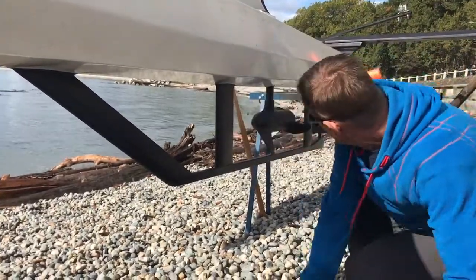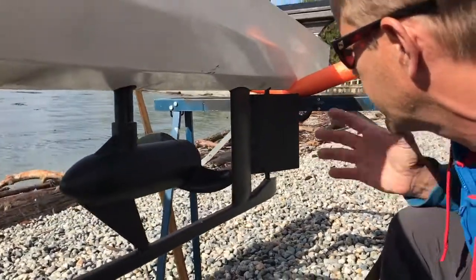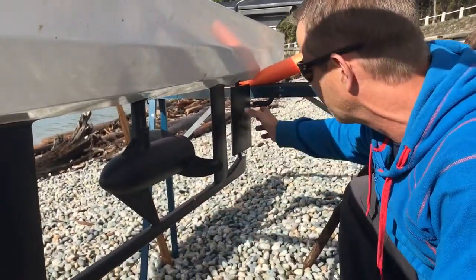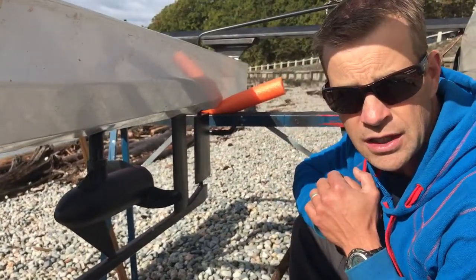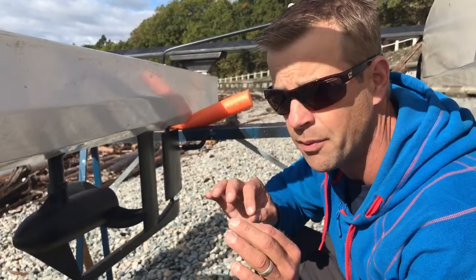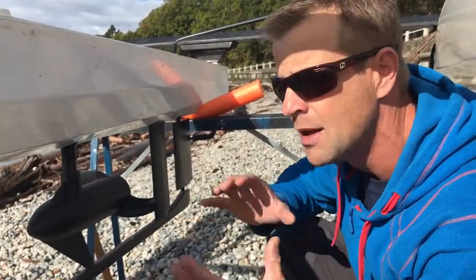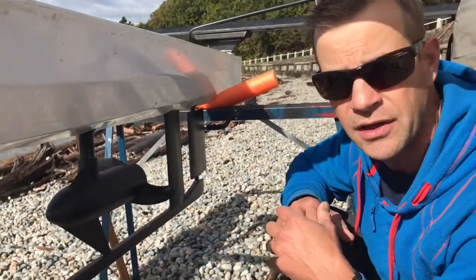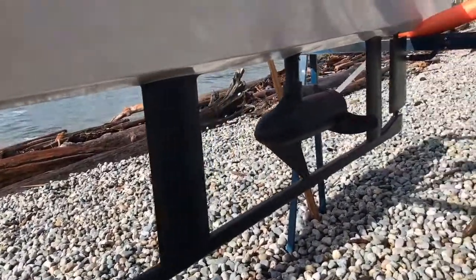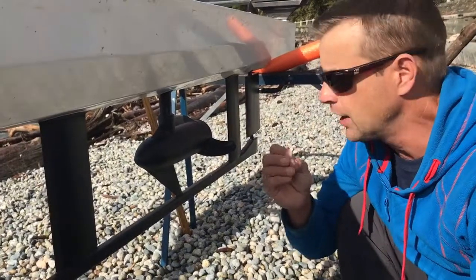This is not the final propeller we're using. The rudder, as you can see back here, is built into the whole unit — it's not the most effective style of rudder; having it go down further would be more effective for turning, but it is completely protected. When seaweed or anything else comes along it's not going to snag up in that rudder, and that's the balance we're trying to achieve — efficiency without things getting snagged. One of the biggest issues with autonomous boats — there have been 27 attempts to cross the Atlantic — is getting snagged in fishing nets and seaweed. This is probably the least vulnerable system that's ever gone in the water as far as having appendages that can snag, and we don't want to create too much drag either.